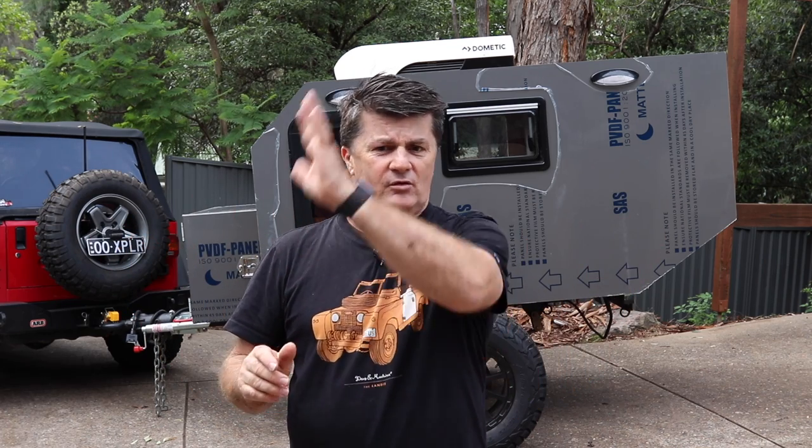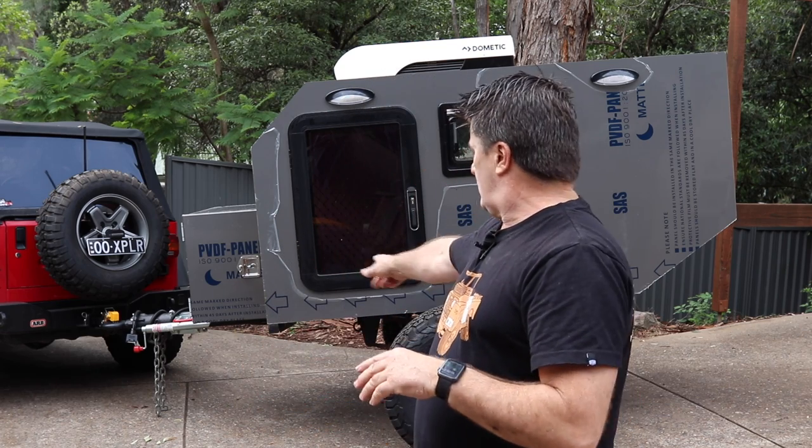You wait for it to have no tack — you put your hand on it and it feels dry — but when the two surfaces come together it's stuck rock solid, to the point where I was cutting out the windows and doors straight away. Really impressive stuff, quite good to work with as long as you realise you can't move it around. When I put the first sheet on, I clamped some bottom braces to line up the base. On the second sheet I also put a guide at the front, so I could line it up in three sections before pushing it on. The other side turned out perfect; this side I'm about half a millimetre out at one point.